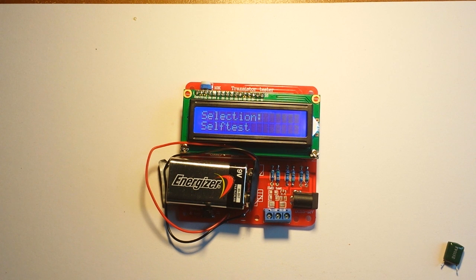I got this from Banggood. I think it was around six or seven dollars, and it took me about an hour to put it together. I was trying to power it from an external DC jack using a five volt supply since it's based off the Atmel ATmega328P, but five volts is not enough power. You need nine volts to make it work correctly.